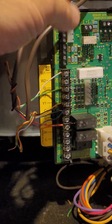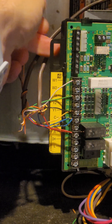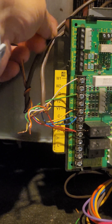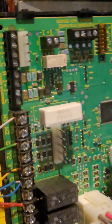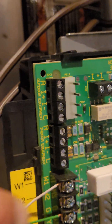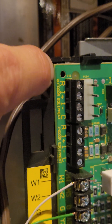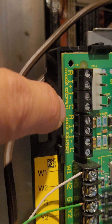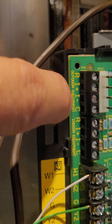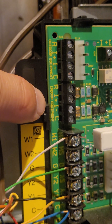Then what you'll see is the furnace control board. What you're going to see at first is your two wires — one coming from your thermostat, one going out to your air conditioning if you have it. If you don't have air conditioning, you're only going to have one wire coming from your thermostat, and then you don't have a smart hub controller probably either. Your wires are all going to be connected up here. You've got your outdoor, and you can see R and C. Your R is your power — 24-volt — and your C is called your common. Then you have plus and minus: I-plus, I-minus. You're just going to take those out, and then you've got your indoor equipment — take that out too, and you'll have two wires coming down that are not connected to anything.